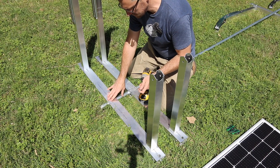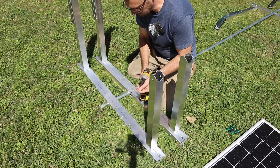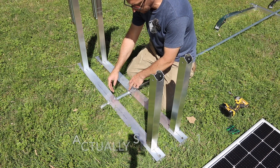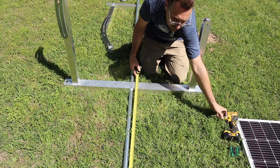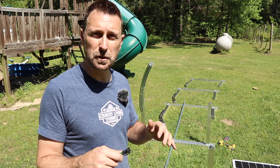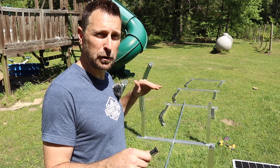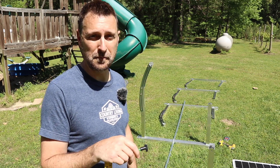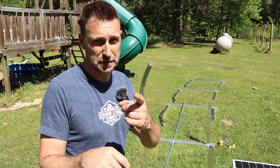What you want to do is lock in this end one first, and you want about two inches of conduit sticking out of the end. Take the width of your panel and add one inch — that'll accommodate it perfectly. It's important if you're going to permanently fix this to the ground to have everything level. You'll need to add dirt or take it away depending on how your property is. If you're pouring a concrete pad, of course it's going to be flat and level.